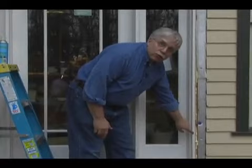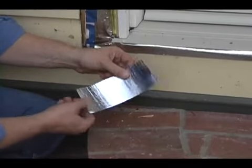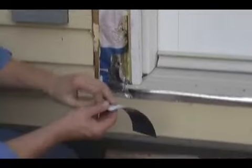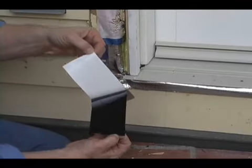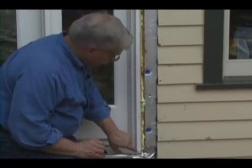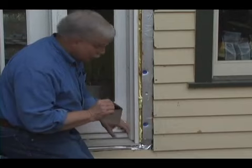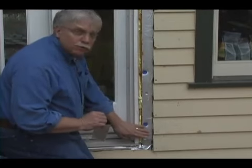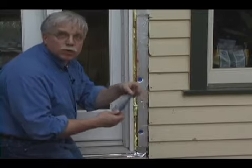There's one last thing I want to show you. Once the foam cures and gets hard, I'm actually going to seal the gap between the door jamb and the sheathing with some of that special sticky flashing tape. I've cut a small piece here to show you exactly how I'm going to do it. I'll peel off the back — it's this special silicone paper. Once the urethane's cured, I don't want to come over all the way to the edge because there'll be some reveal. I just want it to lap about a quarter inch onto this prime surface, and then the woodwork trim will eventually cover it. But it will completely seal over this gap, and I'll have one continuous piece all the way up to the top.